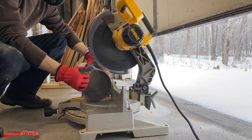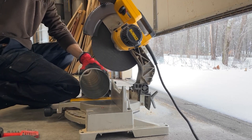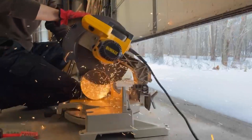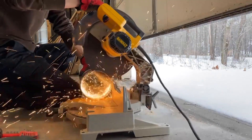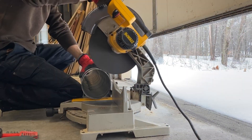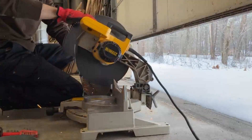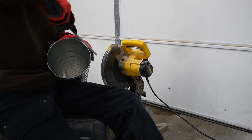I also wore all kinds of protective gear. If you're going to use a grinding wheel to cut metal be sure to play it safe. In addition to the potential for personal injury, all of these sparks do pose a fire hazard in a wood shop. I've seen leftover pockets of dust on the miter saw itself form into a small ember when hit by a concentration of sparks from cutting metal. Please take every precaution and consider cleaning your tools of dust before you use them to cut metal. The grinding wheel leaves a bit of a burr on the ducts so I file down the edges after each cut.